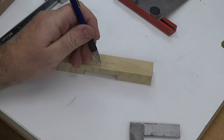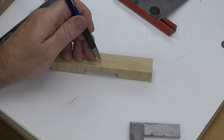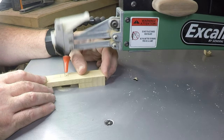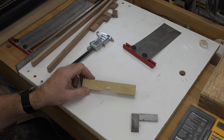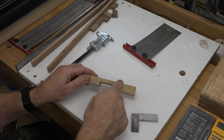So guys, we've already got the 1/8 drill bit in the drill press. I'm going to drill a pilot hole in this, and we're going to take it over to the scroll saw and carefully cut this out. And in no time at all, you have your bumper hole finished. So now it's time to cut those angles that are on this front section of the bumper. They're cut on the 3/4 inch side. They're a little swanky. We'll have a flat spot here of 3 1/4 inches.